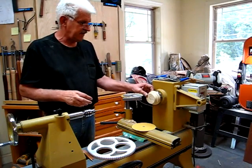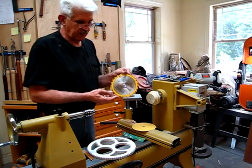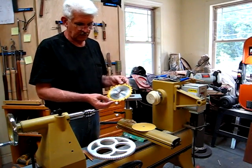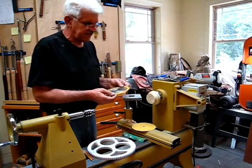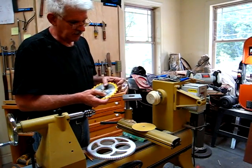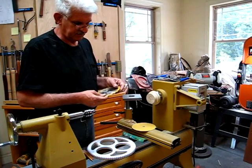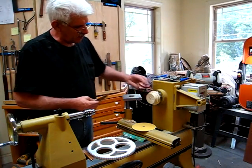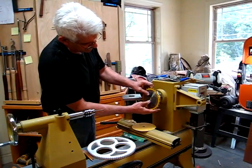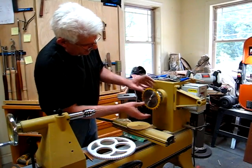This is an arbor that I made. This is a four inch faceplate. And then I took an old saw blade — this saw blade is a six and a half inch thin circular blade out of a battery saw, so it's real thin. What I did is I first took the grinder and I ground behind the tooth all the way until I got to the bottom of the carbide tooth. Then I took a little wrench and I just broke those off. Once I got all that done, I made this arbor, and you can see I made a little shoulder here at 5/8 inch, so it holds the center of the blade just right at the right place. You can push the blade on like that.